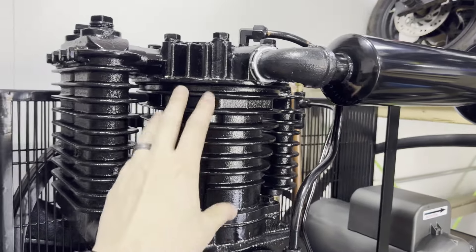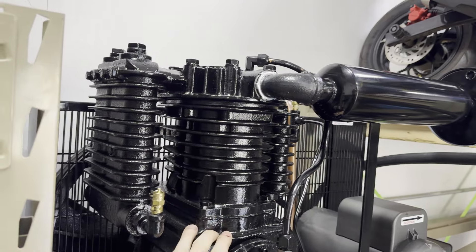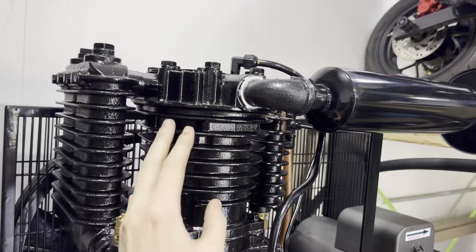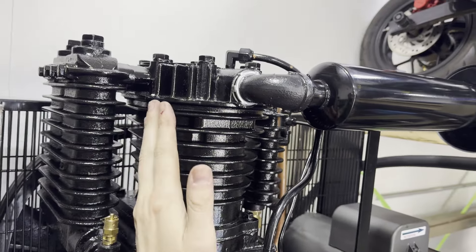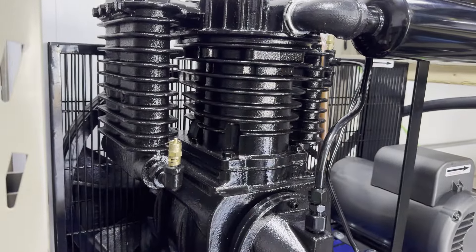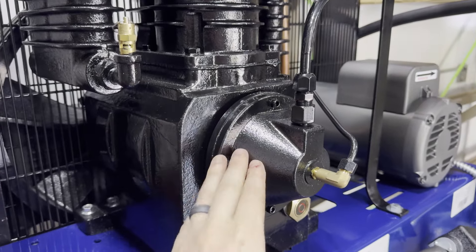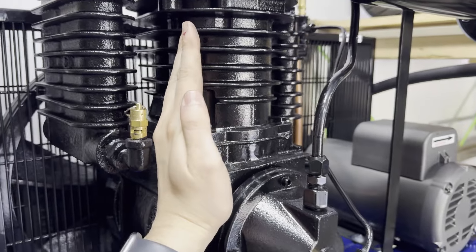Getting into the nitty-gritty of the pump: the valves are disc and spring valves as opposed to reed valves used by many other manufacturers. The head is complete cast iron construction, and the pistons have four rings as opposed to three. This particular pump is an inline two-cylinder, with the crankcase, cylinder head, and entire construction in cast iron. It utilizes an automotive style crankshaft with tapered roller bearings on both ends and a steel connecting rod.